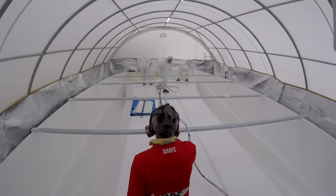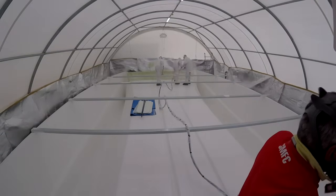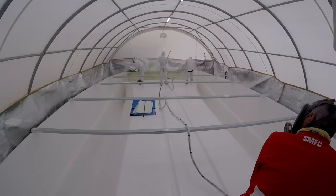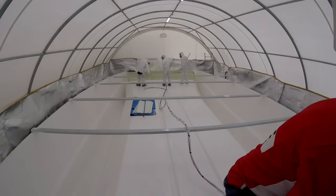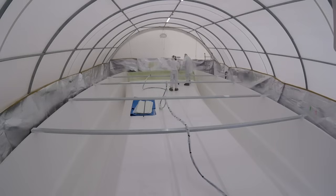A couple of really interesting facts for the day: we used a winter grade vinyl ester laminating resin, which was catalyzed at 1.6%. We had 58% humidity at the beginning of the day, and it dropped to around 45% by around 7pm that night. Our temperature never reached over around 20 degrees Celsius — so that's sort of optimum laminating conditions for this particular job.